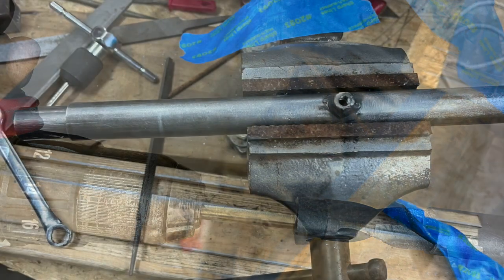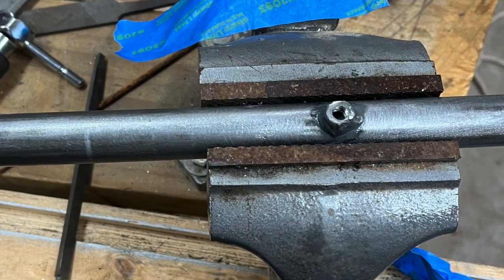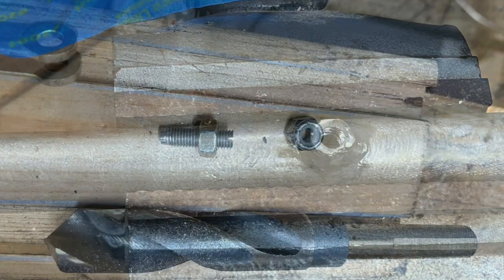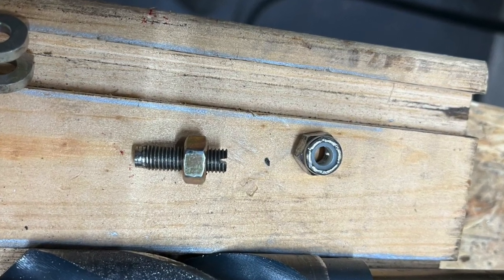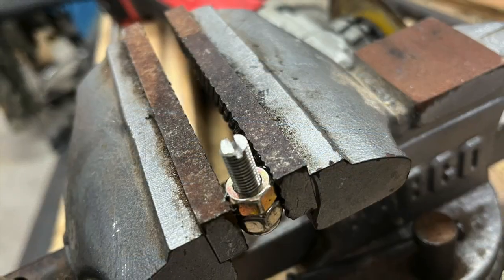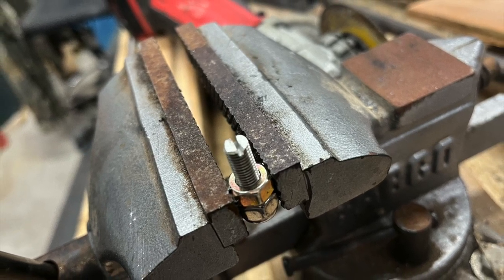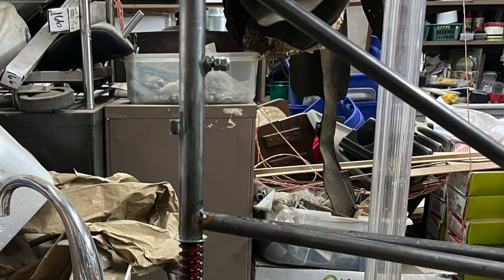And I ran a 1/4-28 tap to clean out the threads of the welded on nut. The 3/4 inch tubing now freely slides through the tail post. I then cut off a piece of the 1/4-28 all thread that will be used for my aileron forks later, and cut a slot for a screwdriver. Now I'm ready to hold my tail wheel in the tail post.